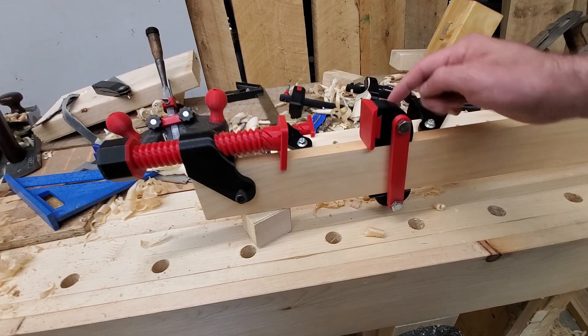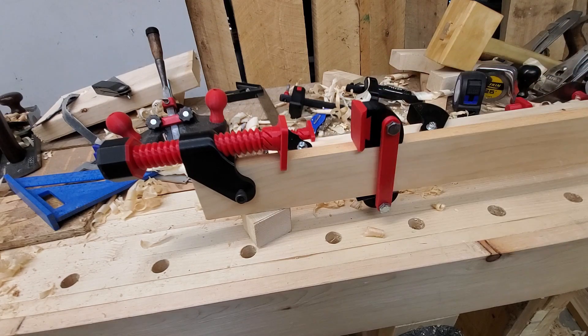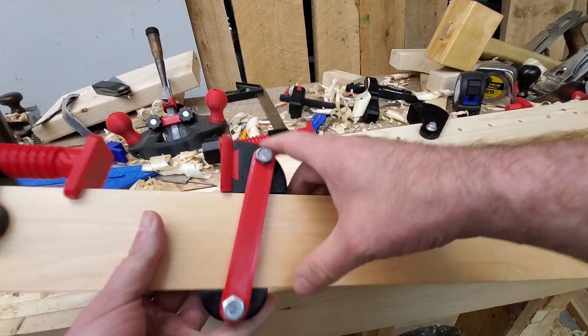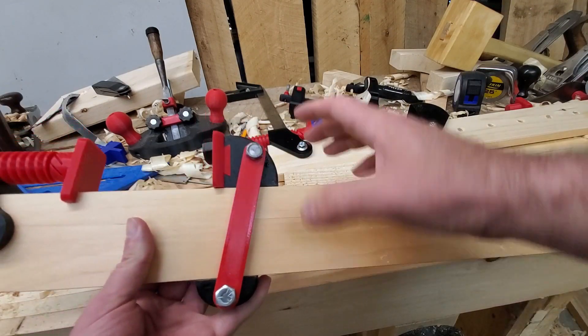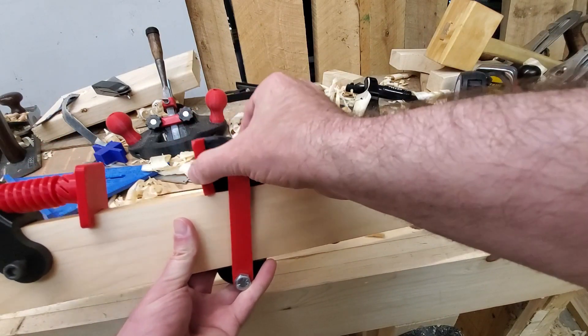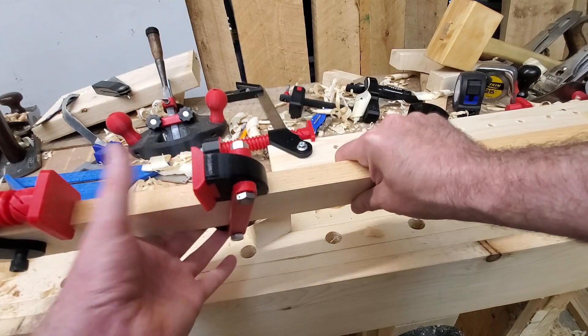A good idea I haven't done yet is to add some lock nuts on these bolts that hold the assembly together. The sliding jaw assembly is put together in multiple pieces — this had to be printed in this orientation for optimal strength, where the bolt is bearing on that. But I wanted a slightly wider clamping surface, so I put a tapered dovetail that is an interference fit so you can just push this pad in place and it binds and locks down.